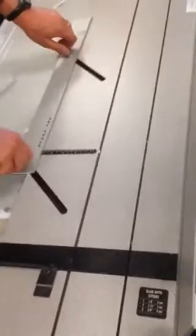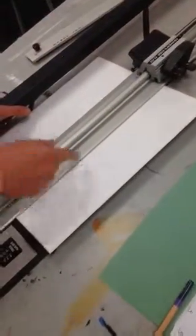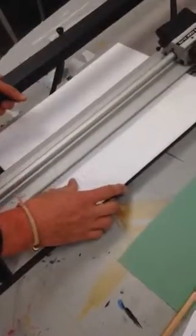The machine has a slide bar on the side. So what you do is you lift this up, and you're going to actually have to remove this slide bar. Don't unscrew these a lot, just 1, 2 screws, and it should slide off, and you set it right there. Then you stick your frame in the measurement on the right side. So you have 2 cutters here. The right side goes straight and it also clicks down. And the left side cuts the opening. It goes at an angle. So you'll be using the right side to cut the frame to size.